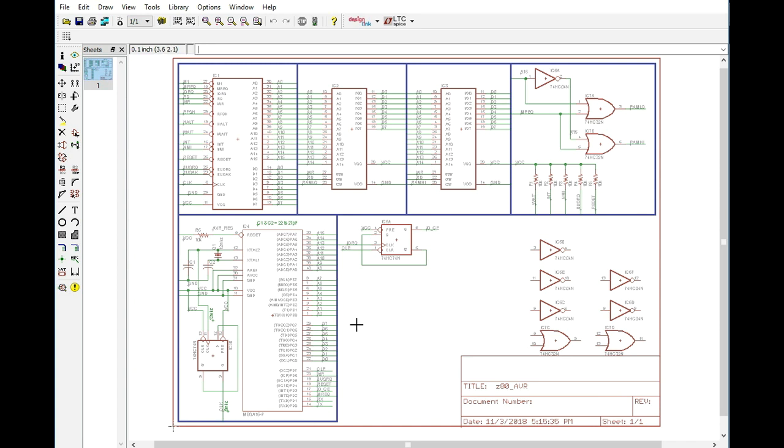First off, we're going to need to change the memory circuit here, the decoding scheme. The reason for that is because I want to keep the chip count low on this, because I plan on prototyping this before I actually design the board and send it off for manufacture. So we need to actually slim this down a little bit.